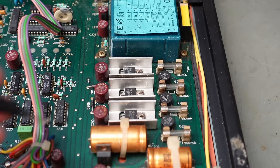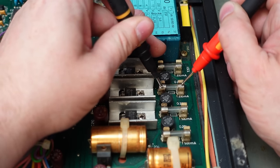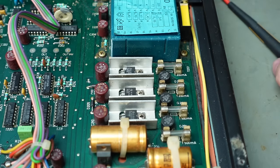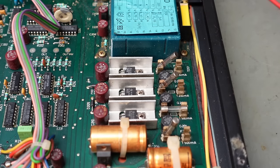We've also got a minus 15 volt rail with only 0.5 volts on it - not healthy. I guess we should check these fuses before we go any further. Dead. Also dead. That one's okay. And that's dead. Dead, dead, dead. That's quite a lot of problems.